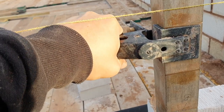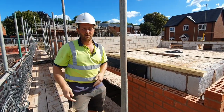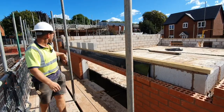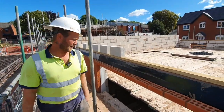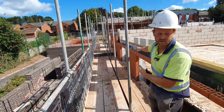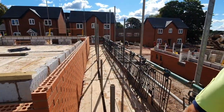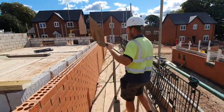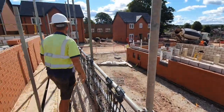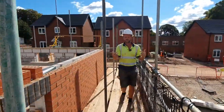If you don't get these wall plates level, it affects the roof line massively. You'll see all these little bows, which is horrible. That is perfectly straight, perfectly level. We've weighted this long one down with a few blocks, and everything's nice and neat. If you look down the scaffolds, they're clean. The scaffolds will come back in, they'll be happy. We're happy. Found a shovel — I'm happy about that. But everything's spotless. Inside's spotless. Outside's spotless.